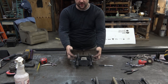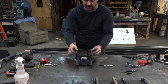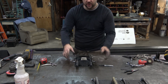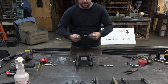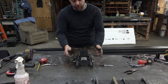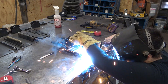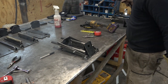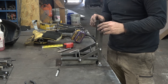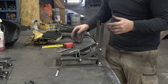So now what we have is the basic assembly. We've got these two arms — they're loose, kind of sloppy, but that's okay. Make sure this thing moves through the entire range of motion you're expecting. Make sure nothing's binding up, nothing's hitting where it shouldn't. Now we move on to the bottom piece — you're just going to bend it like that. It's got two sets of tabs that drop into these two holes. Before you weld anything out, run this mechanism down, make sure they're sitting pretty good. We're going to tack right here.